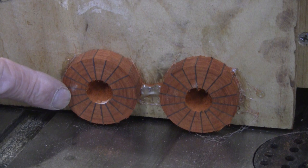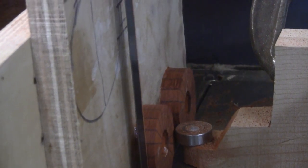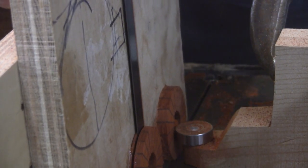Here are two segmented rings that I've glued up. I have them on my bandsaw on my sled and I'm going to slice them into little discs. I missed a little bit here because we're having a furnace put in right now. I'm using a half-inch wide hook tooth bandsaw blade, 12 teeth per inch, and a very slow feed rate. Doing that, I generally have no sanding to do — at most I just hold the piece by hand on 150 grit with a couple of circular motions and they're ready to glue together. After each cut I slide it against my stop which has a ball bearing on it, maintaining the thickness. In this case I ended up with 155 thousandths for each ring.